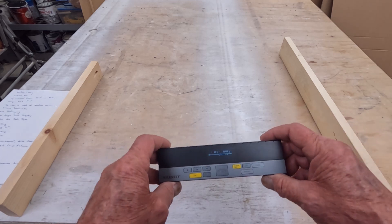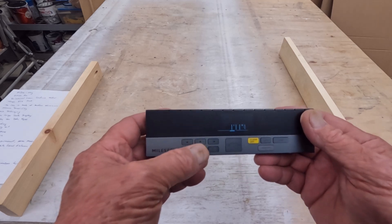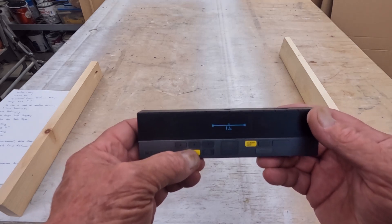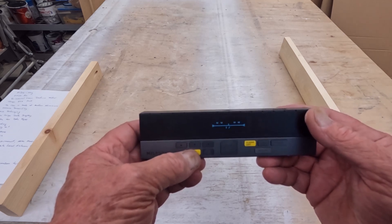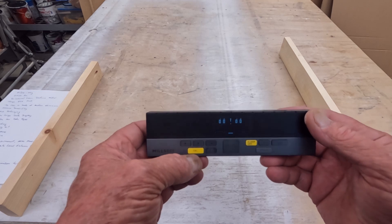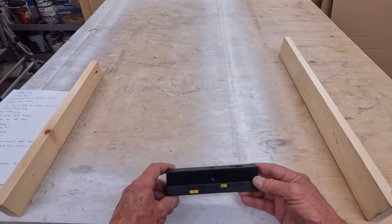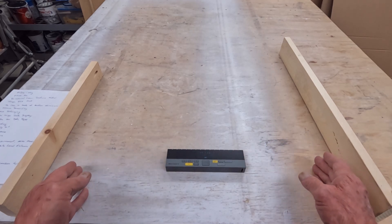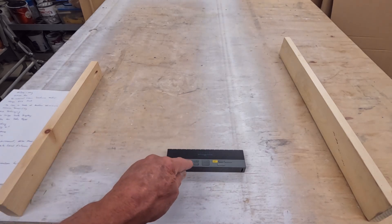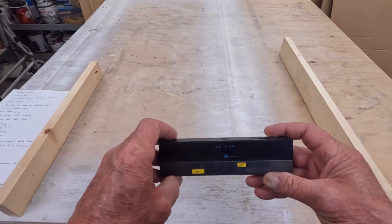While still in bilateral mode, this yellow button lets you cycle through divisions: one-sixth, one-seventh, one-eighth, all the way through one-sixteenth, and one-half. We're going to play with the one-half measurement. That's going to allow me to place this device exactly in the center of these two boards. The center laser — you hold the button for a second — is now on, and you can see the red line emitting right here.